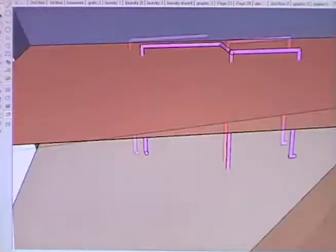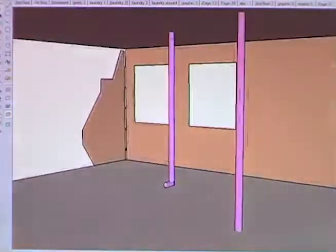Repeat this process for another outlet in the second floor hallway. I drop a plumb bob all the way from the attic into the basement. Now we have a way to get the pipe from the power unit up to the attic. From the attic, the plan is to run the pipe downward inside the walls to reach the outlets on the second floor.